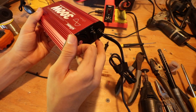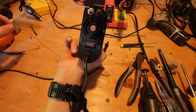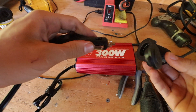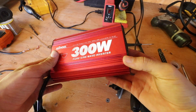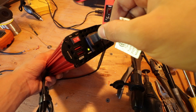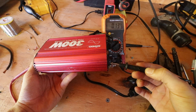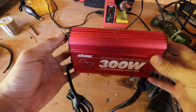Okay, it's done. Overall I think it looks pretty great for being done all by hand. And to ground it, all you would have to do is get some sort of connector, put it in the bolt, and screw this second nut down. Let's test it and make sure everything's working fine. Okay, it turns on. I'll try running my light off of this — it turns my light on, and the fan switches on nicely. Testing the ground — it looks like it's a good connection. I hope you enjoyed, I really like the way this turned out.